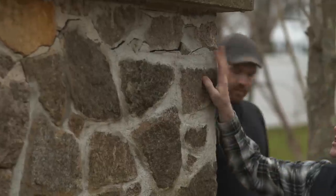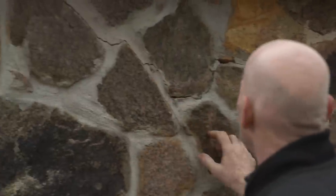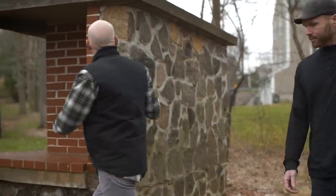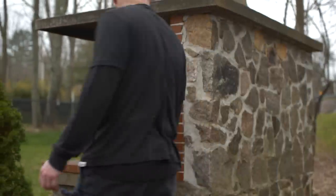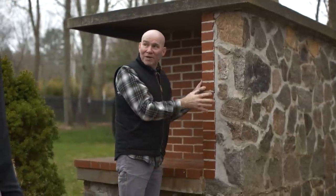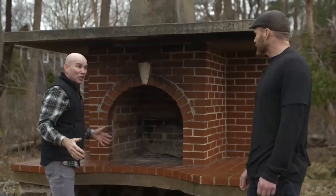Benjamin, you can see that the damage continues up here. It goes all the way through the whole side. All these cracks we're going to have to cut out, just like we do on the other side. And as we go around this side right here, this is the same damage that we saw between the brick and the stone. So this joint has to come out. We're going to have to repack that. We have a joint that comes this way on the horizontal. And that'll bring us out front, which things are looking pretty good. We have a couple of holes back here. I don't know why they're there, but we're going to fill them in.